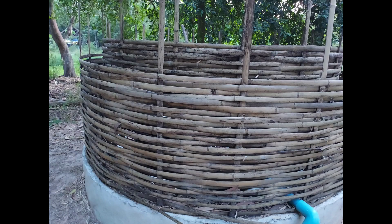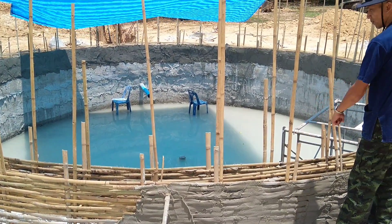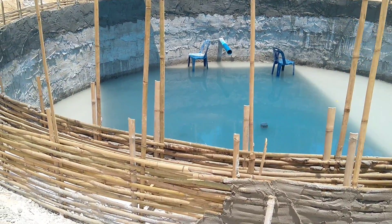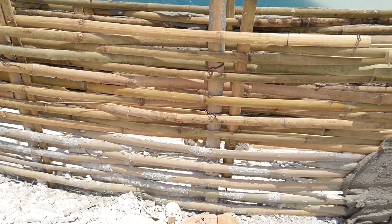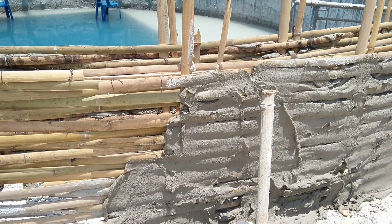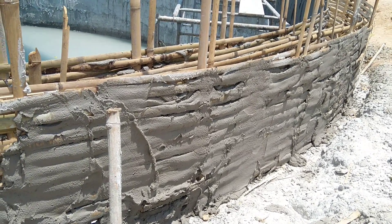Making the giant water tank, we start from weaving bamboo to reinforce the cement at the floor. Put thick weaving bamboo and the pipe, drain the pipe, and then we pour concrete over it. At least the concrete on the floor has to be 6 inches. And before the concrete dries, we put a bamboo stick into the concrete — about one foot apart. When the concrete dries, we use the long bamboo strip to weave around the sticks very close together.